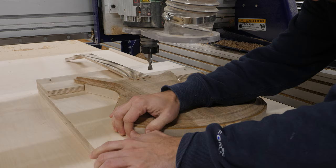Now it's time to flip the pancake and cut some features on the back of the guitar. I'm drilling for some string ferrules, and next up I'm going to be routing out for the control cavity. This is hogging out a lot of material, so I use an approach called rest machining — basically you cut away the majority of the material and then the rest of what's left behind is cleaned up with a finishing pass. The reason I didn't cut the holes for the control knobs and toggle switch to full depth earlier is because once I got the control cavity to full depth, I would lose vacuum and the guitar body would lift up off of the table. That would be not good.